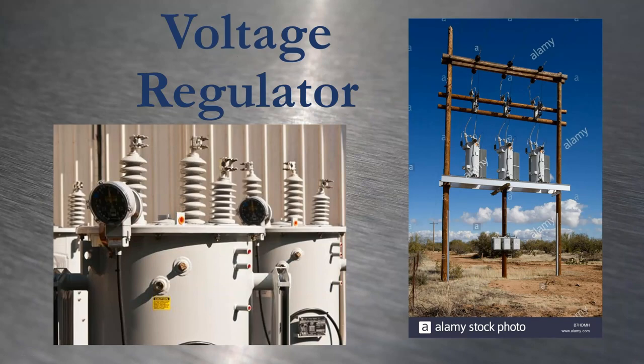This is nothing like the voltage regulator you'll find in small electronics. Similar to a load tap changer on a big transformer, a voltage regulator is a huge, typically oil-filled, single-winding auto transformer with an electrically controlled tap changer that keeps a steady output voltage for an entire facility's medium voltage distribution. If it's bolted to a transformer, we call it an LTC — a load tap changer. If it's a standalone unit, we call it a regulator.